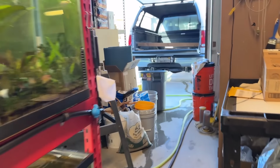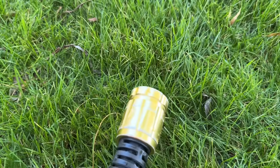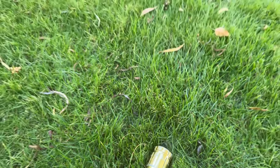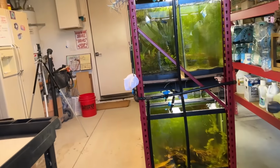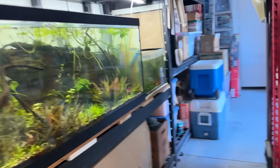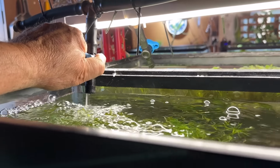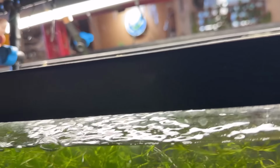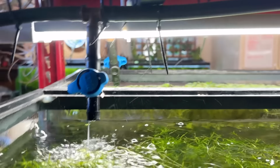All right. Now let's go make sure we got water coming out of the end of the hose. The permanent drain line should be draining. All right, there it is. So that's working. So we got water going in, water going out. Now the key is to throttle the valves so that way they sort of meet in between. Now the drains are wide open, and obviously these fresh water ones are not. So I can even maybe throttle this back some. I still hear air coming out.